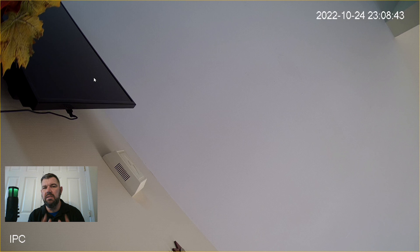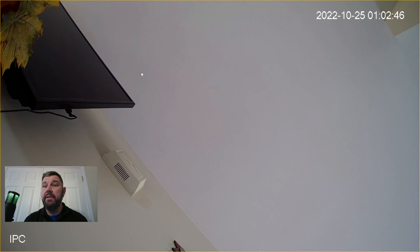We also showed you that if you want to use your camera as a standalone IP camera, all you need to do is run a cable directly from the IP camera to the PoE switch, which would be linked to your modem or router with active internet, and deploy the phone app. For a Dahua IP camera, use the Dahua DMSS app from your app store. For a HikVision IP camera, use the HIK Connect app. Log into the camera, go to Network Settings, and under Advanced Network Settings you'll find the P2P platform with the QR code. Scan that QR code into your phone app, enter your username and password, and you'll be able to view the standalone camera without an NVR — live view and playback.